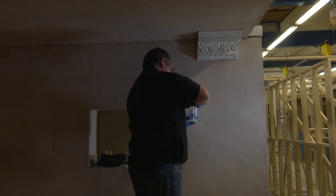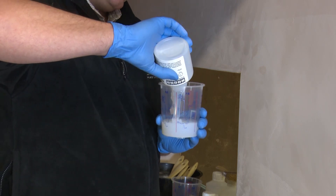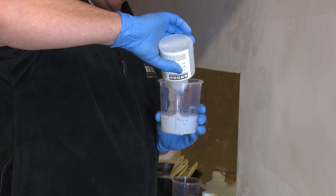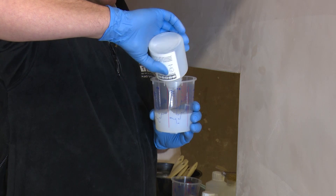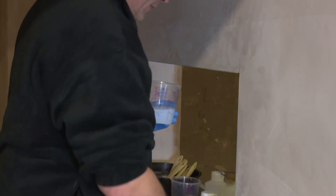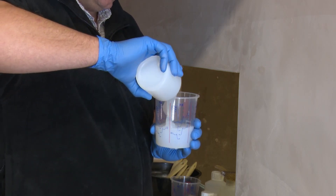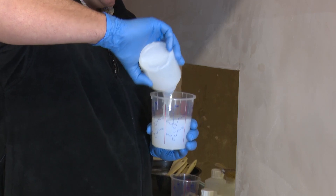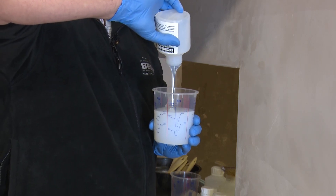Using the cup provided, you can measure equal parts. As you can see it's quite a runny system. You should have around two hundred to two hundred and fifty millilitres or grams. The cups are particularly accurate so you can trust them. Now making sure you've got part B, bring this up to four hundred.